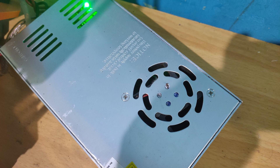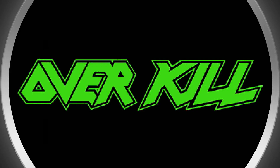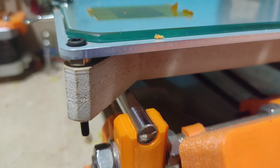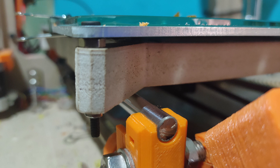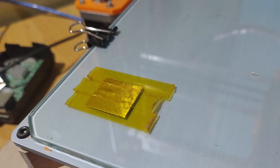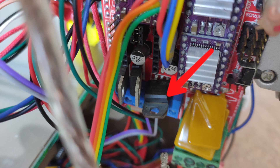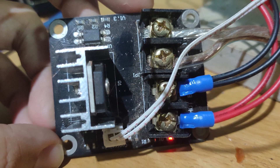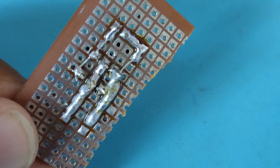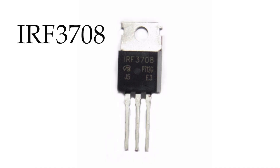I have used a 12V 30A power supply, which is a bit overkill — a normal 20A power supply should work just fine. Fix the heated bed to the Y carriage using 25 mm screws, and I'm also using an M4 nut as a spacer. Note to use at least 14 AWG and above wires for the heated bed, as this does require some serious current. Speaking of high current requirements, the MOSFET on the RAMPS board was just not powerful enough and would just burn off — I had this issue for both of my 3D printers. To solve this, I would highly recommend using a dedicated MOSFET board, as this can deliver a ton of power and decrease heating time. Another alternative is to make your own MOSFET board using a MOSFET such as the IRF3708.